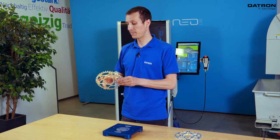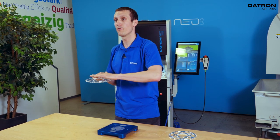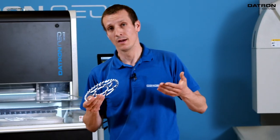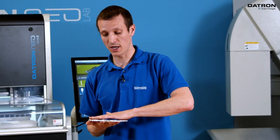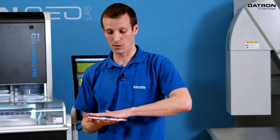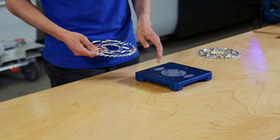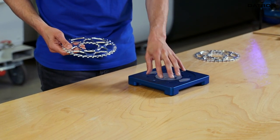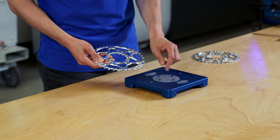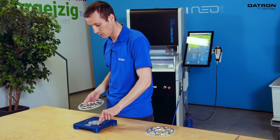Stage number two: how to clamp this now on the milled side, on this 3D curved radius. That's why we used our CAD/CAM system to project the shape of this side and put it on this fixture. So we have a curved surface here, we have the pins, we have the positive of all the breakouts, and we have little slots on the vacuum.